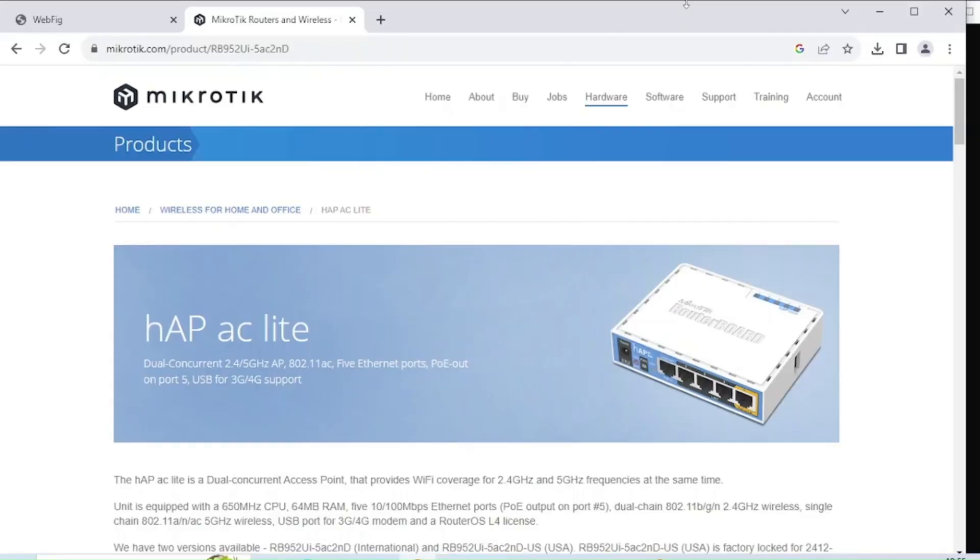In this video I want to show how you can use one of these MikroTik routers to create two segregated LANs and two segregated sets of SSIDs with those LANs. Essentially, internet comes into one of these routers and splits so there are two networks with both wired and wireless connectivity. I'm using the HAP-AC Lite — their other products will work similarly. They're 50 quid, with five fast Ethernet ports at 100 Mbps and dual-band wireless: 2.4 GHz and 5 GHz. For the money they are phenomenal pieces of kit.